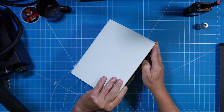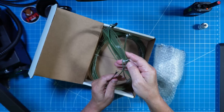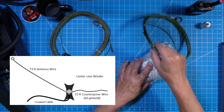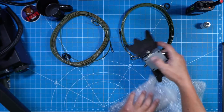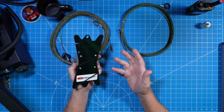The new-to-me MCOM-3 portable has long been in the arsenal of Chameleon. This is a broad-banded portable antenna with a matching unit to which you attach a 73-foot radiating wire as well as a counterpoise. This antenna can be used in multiple configurations — matching unit up high, matching unit down low, installed as an inverted L, or an inverted V. I like an antenna that has a lot of versatility and can be used in a number of different ways. This is primarily a portable antenna.